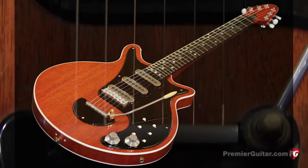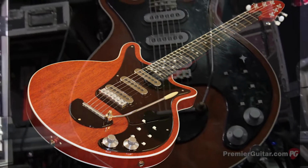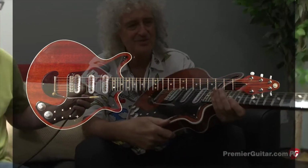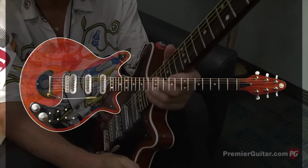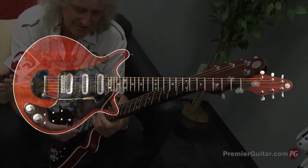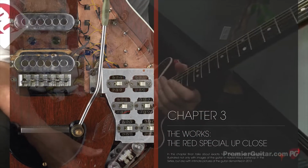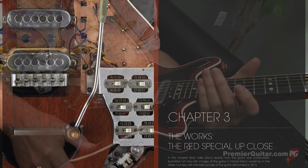The neck of the guitar is mahogany, made from a Victorian-era fireplace mantel. The building which housed the fireplace was long gone, and Harold happened to have the mantel in his workshop. Brian filled the wormholes with matchsticks as he carved out the neck. The center body of the Red Special was created from oak, the wood recycled from an old table. The sides of the guitar could be made of weaker material since they don't have to support the string tension. These were made from blockboard, an engineered material made from blocks of softwood sandwiched between two pieces of veneer.